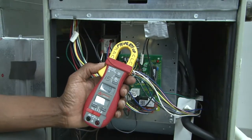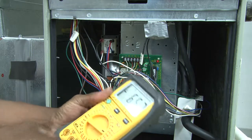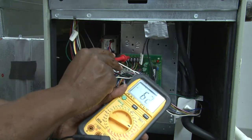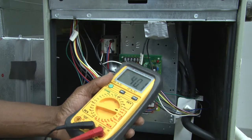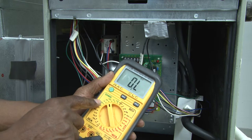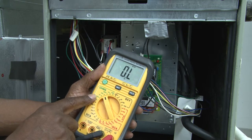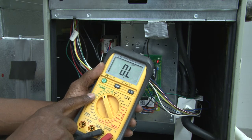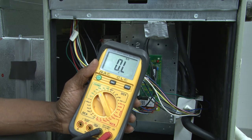And going back again, this is the clamp-on ammeter, and I went around a wire. And for the volt-ohm meter, I actually use this type of meter, which has leads on it, and these leads will go to the terminals to read voltage. Another way we can do this, use this ohm meter to read resistance. And it does resistance very well by turning it to ohms, disconnecting all the power, disconnecting the leads to it, and being able to read the resistance of the loads in the system, or reading continuity of switches or wires to make sure that there's no defects with the switch or wire. So this is a basic type of controls we use for diagnosing systems.